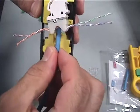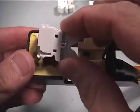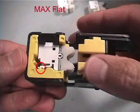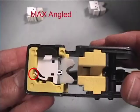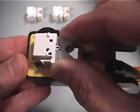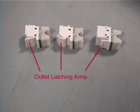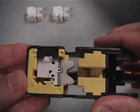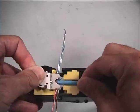With the conductors properly laced, load the assembly by positioning the outlet with the flexible latching arm opposite the metal retention latch of the tool. The holder has features to accommodate the Max flat, angled, and keystone styles as shown here. All three versions are positioned with the latching arm of the outlet opposite the metal retention latch of the tool. The outlet can be used to move the retention latch when loading into the tool.